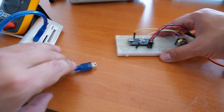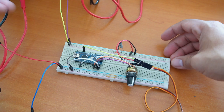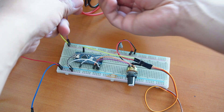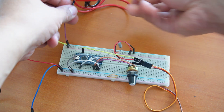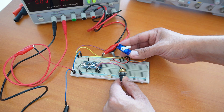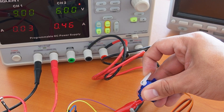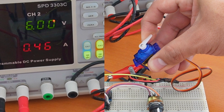Feed your Arduino Nano with 9 volts from, let's say, a power supply, and only connect the signal from the servo to it. The positive and negative wires from the servo should be powered by another source within the specs — always check the datasheet because values change depending on the brand. With this setup we can get the most out of our servo motors. If the servo starts pushing or pulling anything — and that includes your hand holding the motor — the current spikes, and microcontrollers can't handle that. They are made for controlling, not powering devices, so only use them for the signal.